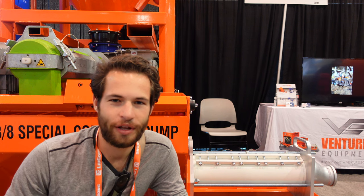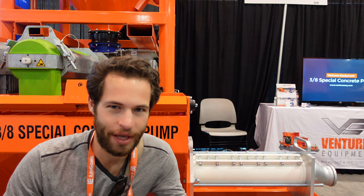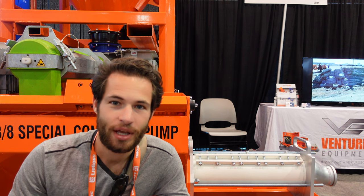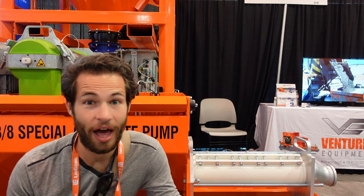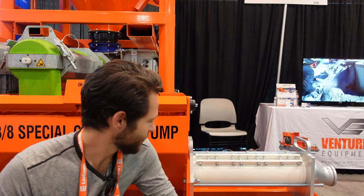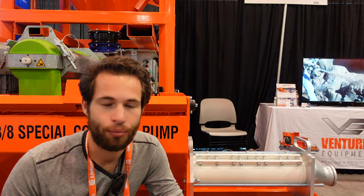When I look at a 3D printed construction setup, I look at the rotor stator — this piece wears down over time and needs to be replaced. This is the biggest rotor stator I've seen. Because of its size, you don't need to run it as quickly, and with lower RPMs the system lasts longer, allowing more yards of concrete to be pumped through. By not needing to adjust this piece as often, you increase system efficiency and decrease downtime. This is an adjustable rotor stator, so you can fine-tune the pressure within the system.